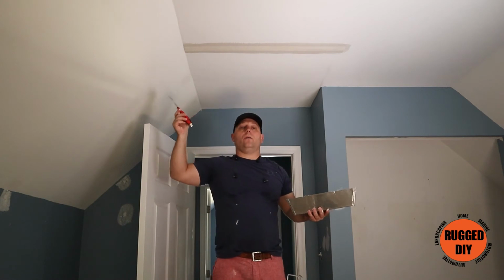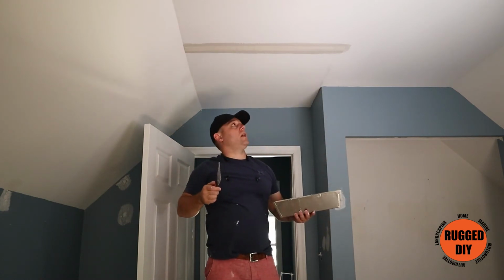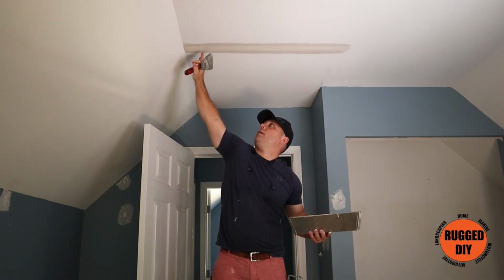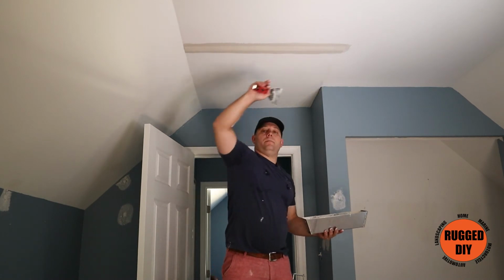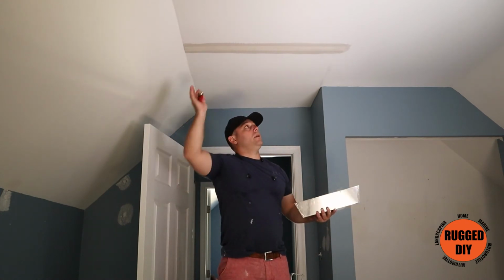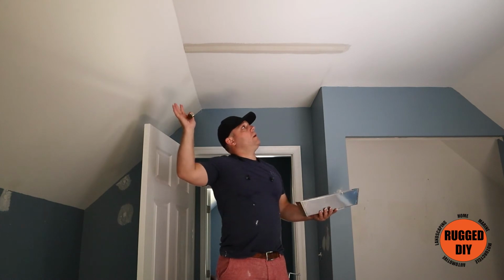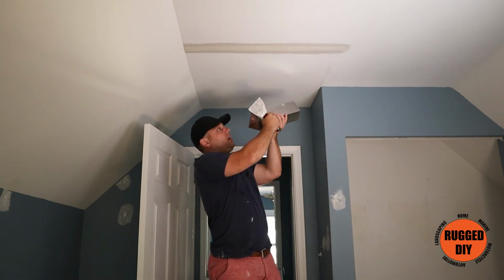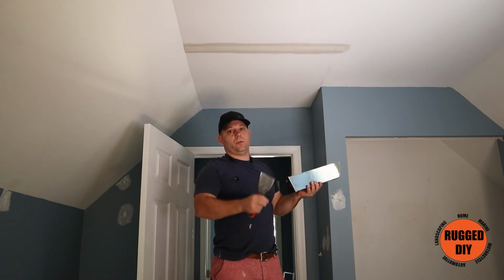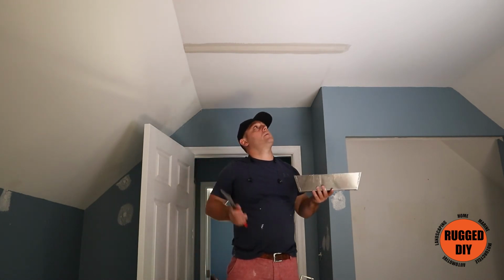And then I come back over that after I've got it all smoothed out, just the way I want, and I put a thin layer of mud over top of it. And then I come back and I remove all of the excess, kind of fading it away at each side so that you can still see the tape, but there's just a light film of mud over the tape, and then it's tapered away. And then we'll come back over this after we've got the other piece of tape on, and then just like in the corner, we'll do our layers of mud and have a gradual work away in layers from the tape so that you can't really see where the seams were. It just becomes a nice taper and your eyes can't pick up the differentiation in layers.